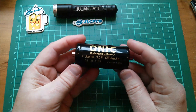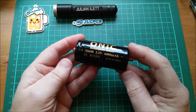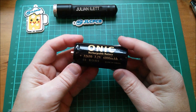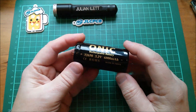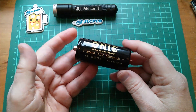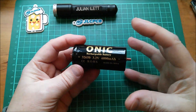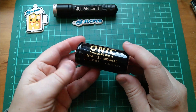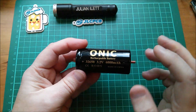I'm now starting to think maybe I'll go for lithium titanate oxide, because with that chemistry — if I build a solar charger — I can ignore the low temperature and just charge it anyway. Lithium iron phosphate you're not meant to charge below zero degrees, same as lithium-ion. Lithium titanate oxide cells are quite big, expensive, and not very high energy density. Lithium iron phosphates are higher, and lithium-ion are the highest energy density.